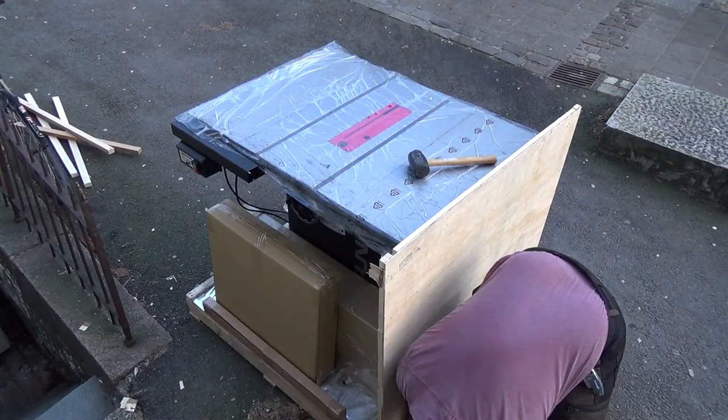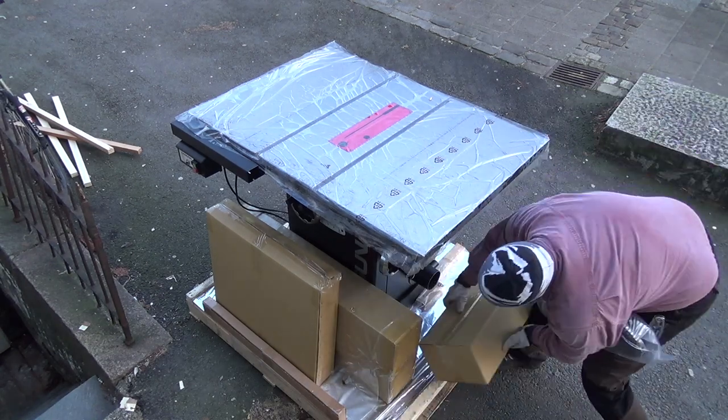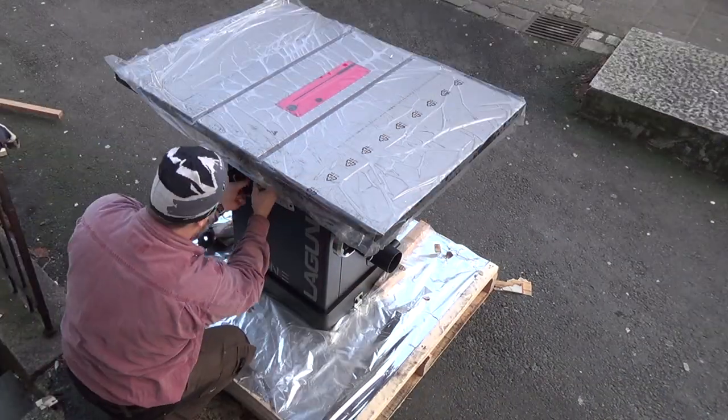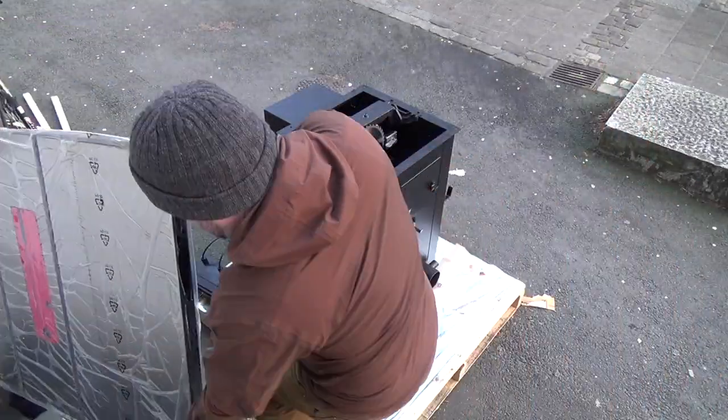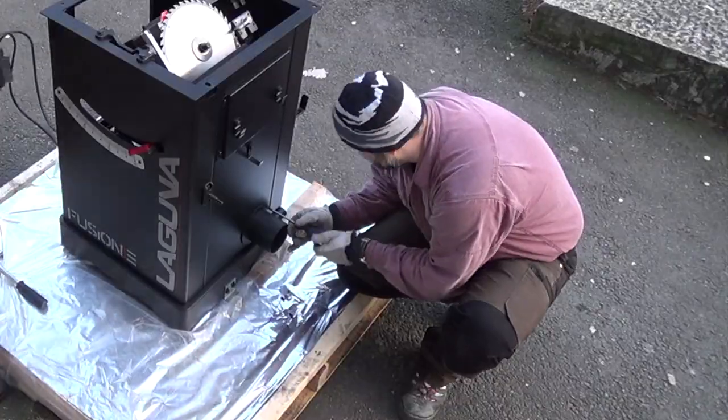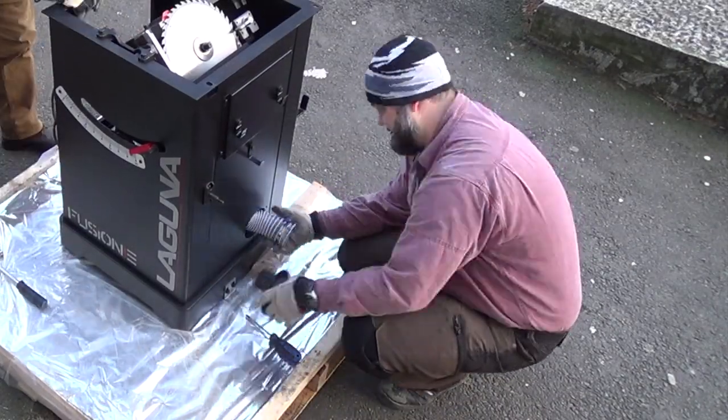Well, first of all, it had to have a quick change function for the riving knife. As I have stated many times, I believe this is the single most important safety function on a table saw, as it makes it easier to change back to the blade guard and not just leave the riving knife on.